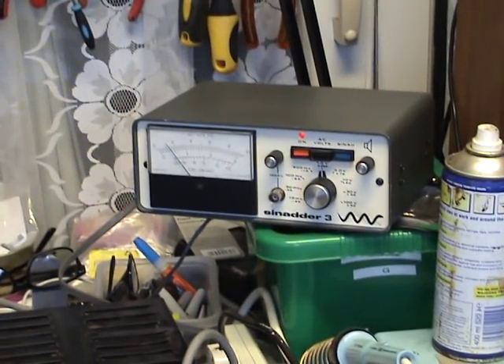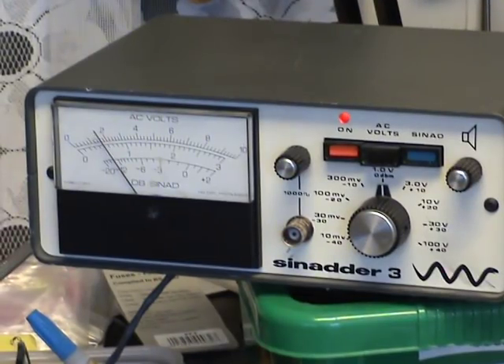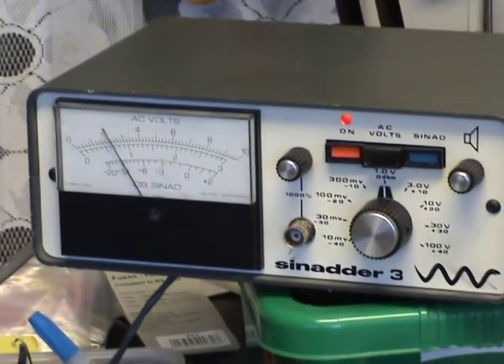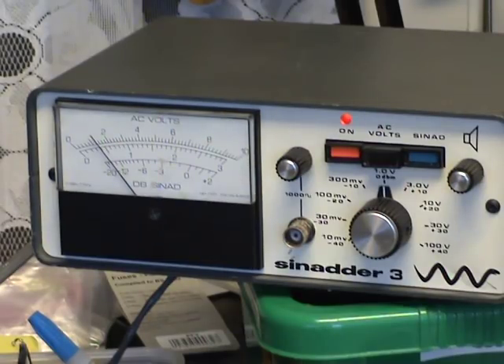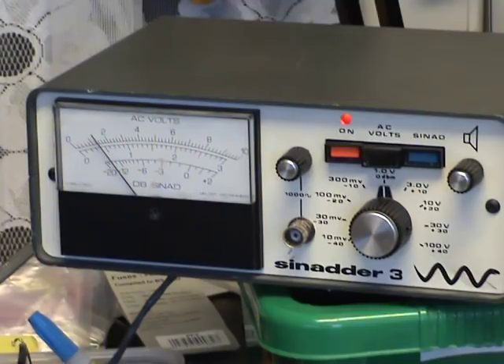This is what I've been waiting for — a standalone SINAD meter. I managed to get this from a gentleman in Canada off eBay for about 90 pounds, including postage. It operates on 120 volts, so we have a transformer under the bench. We don't need FM modulation to use a SINAD meter, because SINAD measures signal-to-noise ratio. What we're able to show on the meter is that when we have the best possible signal-to-noise ratio, we can achieve that by tuning the radio — as we back off the attenuation of the signal generator, the radio gets noisier and we can tune for a better signal-to-noise ratio.